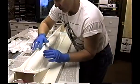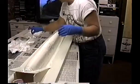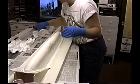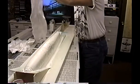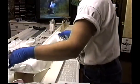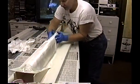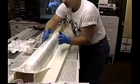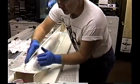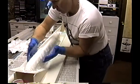I won't leave the camera running all day. I think you can figure the whole deal out here. I had a half one here somewhere. Famous last words. Anyway, doesn't matter. We'll get a long one on here. Just start laying this up. And when the resin stops coming out through the mold, that's about enough light cloth here. That'll work, I'm sure. Need to bury that corner nice.